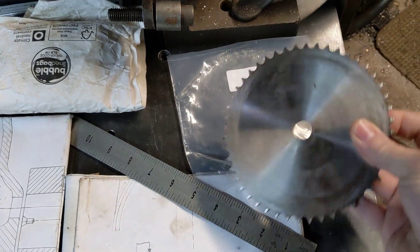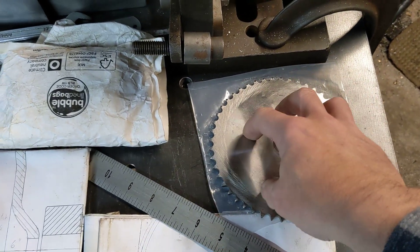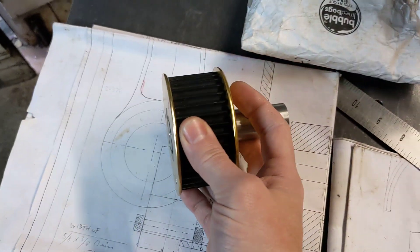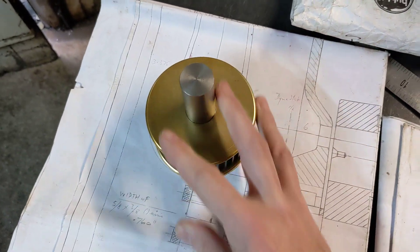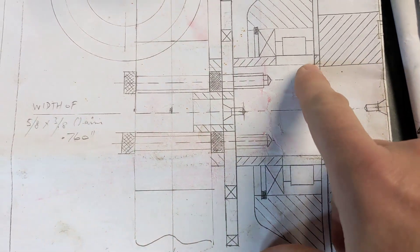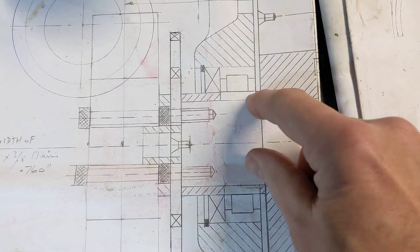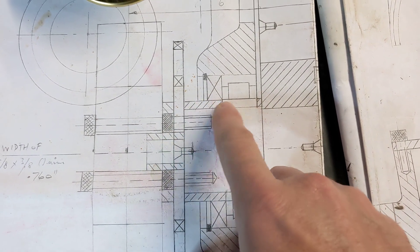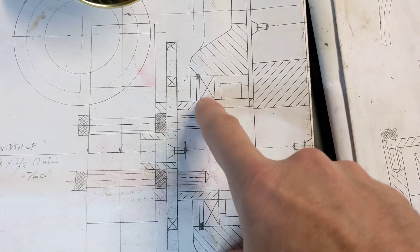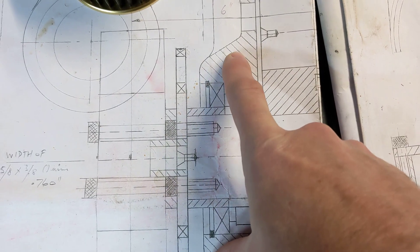This is the 48-tooth large plate wheel that we're going to mount to the end of the crankshaft. On the side of that is going to be the drive for the belt for the clutch, so those two pieces need to go on the end of the crank. As you can see on the diagram, this is the crankshaft, flywheel, drive side. That crankshaft has got two bearing inners on it — one of them the main bearing runs in, the other one provides a smooth surface for an oil seal, which is then retained by a circlip that's inside the engine case.